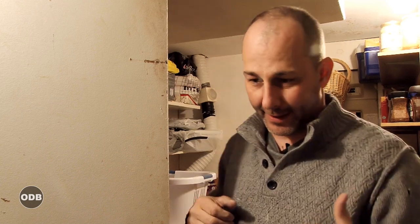Before we tackle this project, rule number one: if you're touching any plumbing or plumbing fixture, turn off the water supply to the house. You might think you've got a shut-off valve and you're safe, but I've been in situations where we just moved something and a water supply line in the wall burst under pressure because it wasn't installed properly. Never take a chance with your water supply.